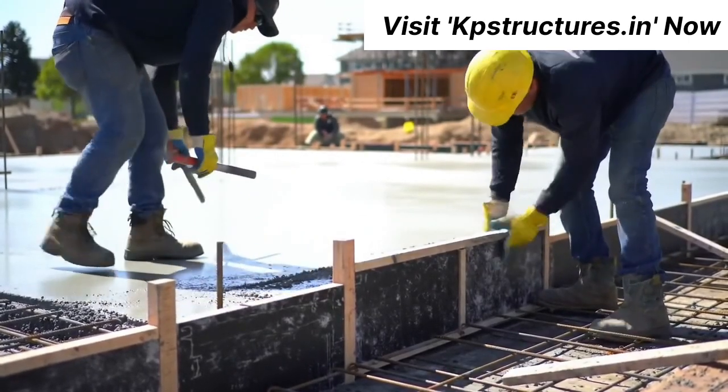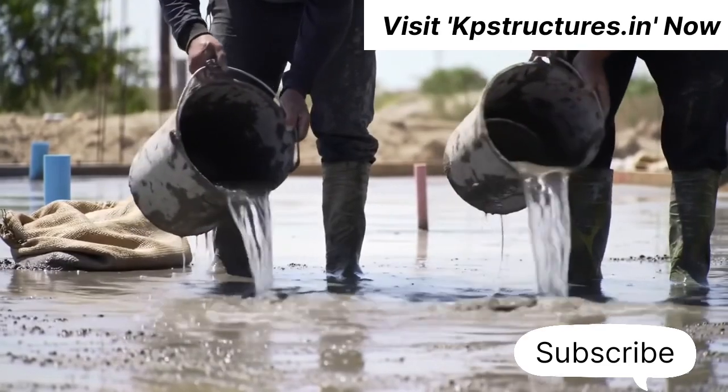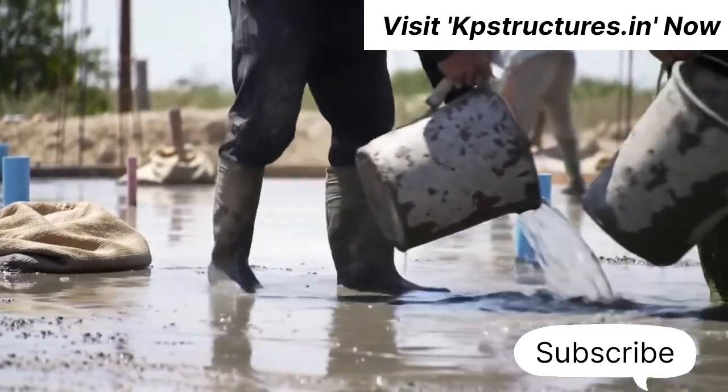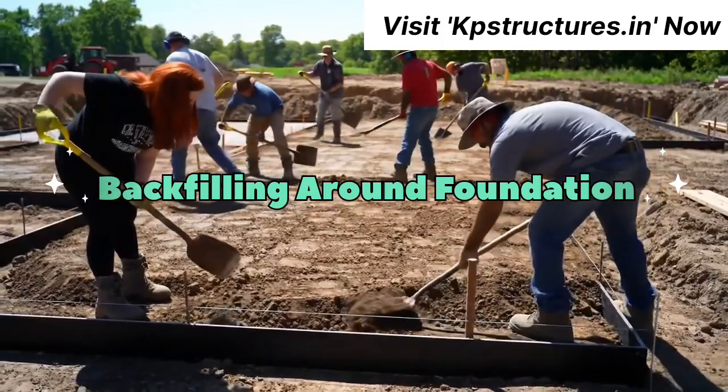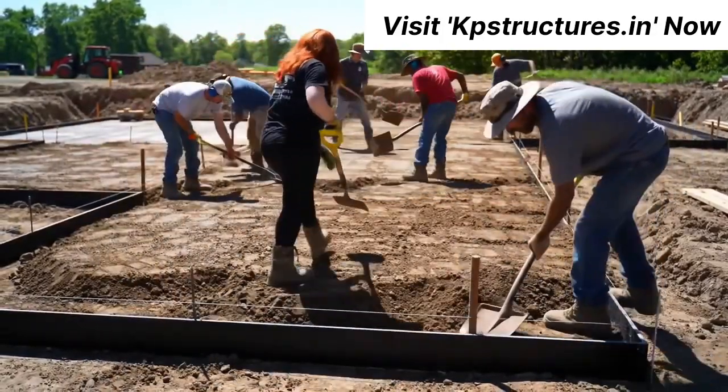The foundation is then cured by regularly applying water to keep the surface moist and ensure proper hydration of the concrete. Backfilling is done around the foundation using soil and compacting tools to provide support and restore the ground level.